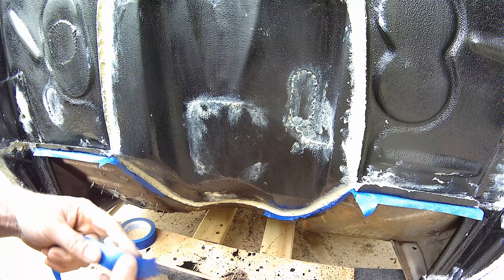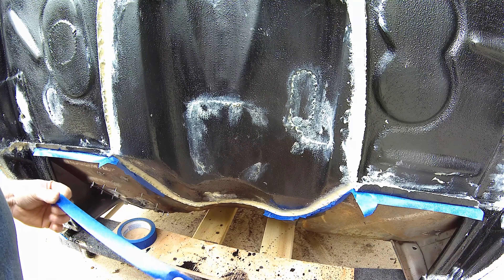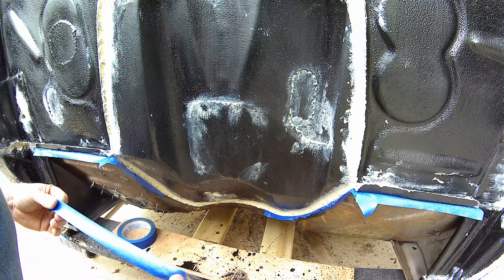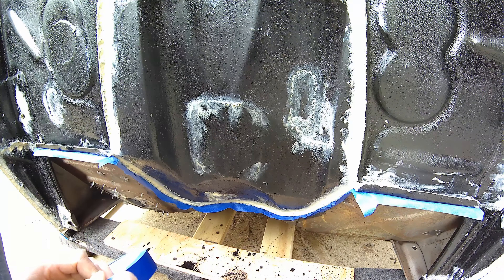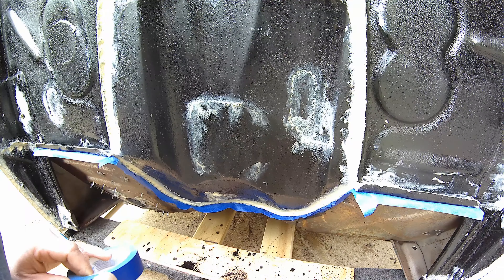This is a technique called back taping — very useful in a situation like this. What it does is it prevents you from having a hard edge on your paint or your material. What you do is take your tape sticky side up and push it on the side of our seam, leaving a lot of tape exposed. Then we'll come back with our drop cloth or plastic and push it on the front and back, giving us a rounded tape instead of a sharp tape.